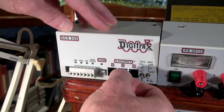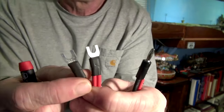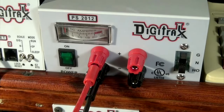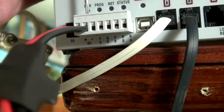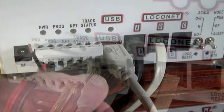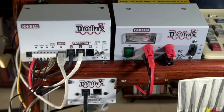I reconnected the LocoNet with the 6-wire plugs into the command station. I modified the Digitrax power harnesses by removing two of the four wires, keeping the inline fuse in place. I cut off the crimped-on wire connectors and replaced these with simple banana plugs, which get pushed into the power supply's front power jacks. The black and red power wires were installed into the DCS240's front terminal, held in place by screws. I attached the two track power wires and plugged in the USB cable, then attached the programming track wires, completing the hardware installation with wiring looking much cleaner than before.